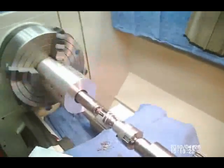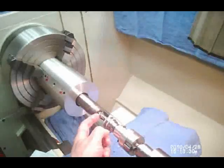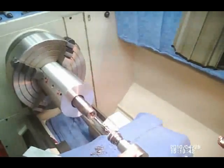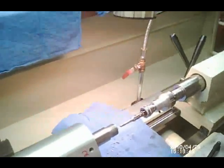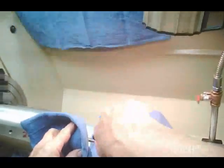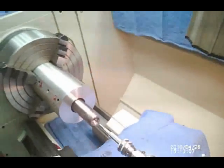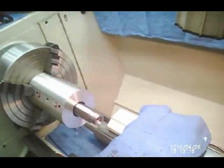The shoulder has engaged. Back your reamer off just a little bit and shut the lathe off — you do not want to drag all these chips back through a spinning chamber. Back your reamer out, take your air hose and a rag held in front, and throw the chips away so you don't get them in your eyes. Pull the reamer back and blow the chips out of the barrel. Now ready to start reaming again.